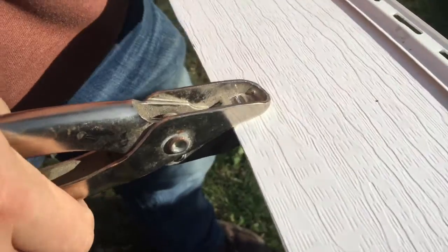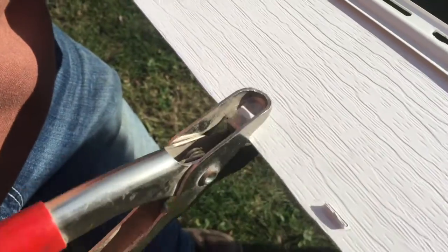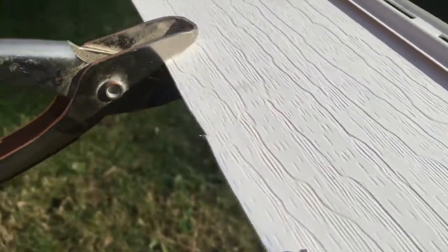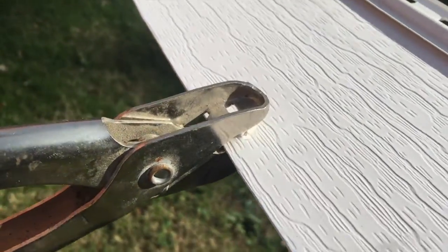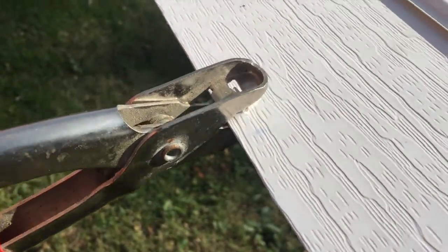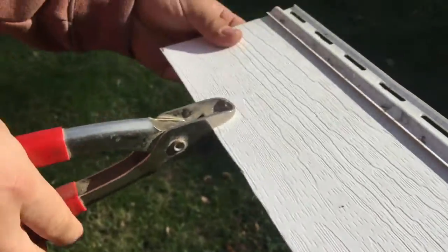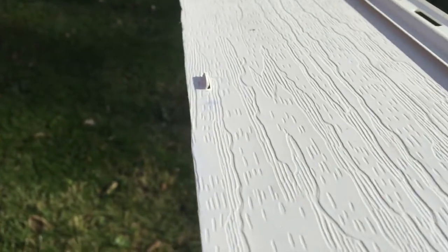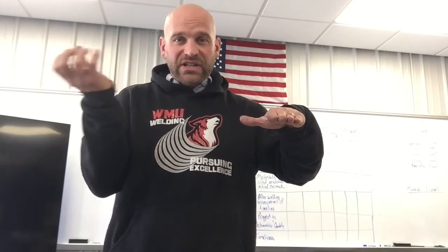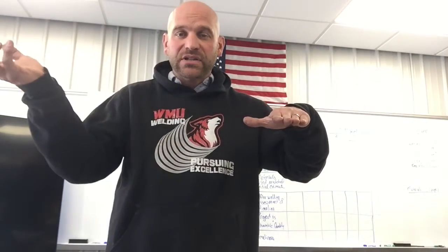Therefore, at the end of your wall, like the top of the wall, or I've also used it underneath windows, and I've also used it where you might have a step in the siding, where this lower part you're having starter and then it jumps up, and now you have like a half piece in order for those lines to match up. Well, this piece that's jumped up, you don't want to leave it just hanging, so you crimp that siding and use dual undersill and have it lock in.